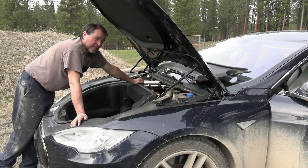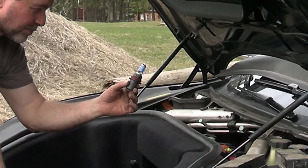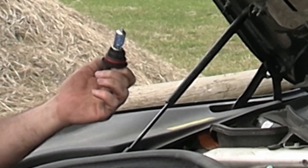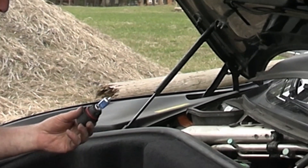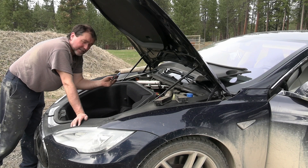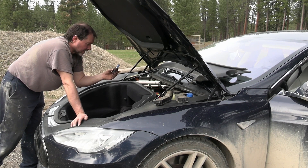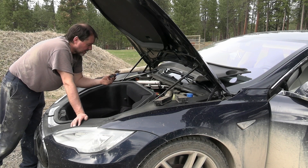Dead short means I put a fuse in and it blows right away. So there's a little trick — what we want to do is replace the fuse with a light bulb. As long as we have a dead short, this light bulb will be on full brightness. And as soon as the short goes away, the light bulb will go off. This light bulb here has a 65 watt element in it, and that's what we're going to use. So the higher wattage the better. If you have a lower wattage light bulb it may start to glow while stuff is going on, and that sometimes can create problems.